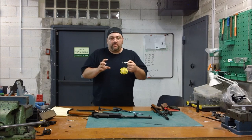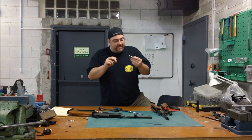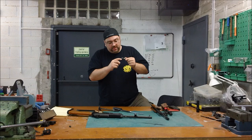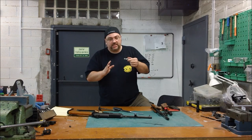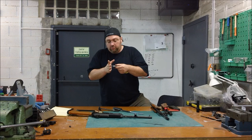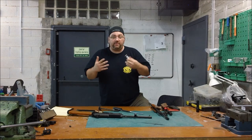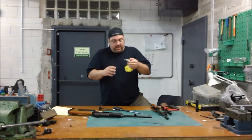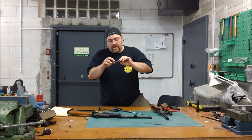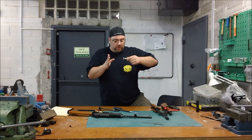he believed that he had a very, very dirty barrel extension. This rifle does have a barrel extension, much like an AR-15. If it was a squared off lug and there was a lot of dirt in there, when this came into the extension, the shoulder here would rest against the shoulder of the barrel. If there was excessive dirt, it would prevent proper locking. It would prevent this from sitting flush, and hence the bolt wouldn't turn and the rifle wouldn't fire. You'd have to clean it out. This little space here would let it lock up. The dirt would go under the little cutouts, the little canted areas, so we could actually lock and turn, fire, and extract, pushing the dirt out of the way.